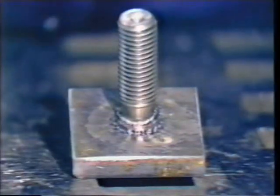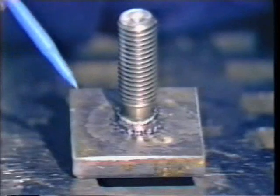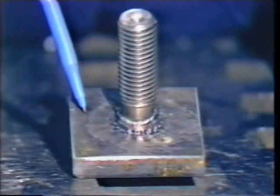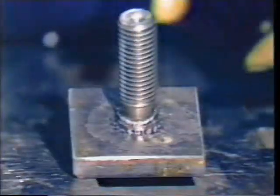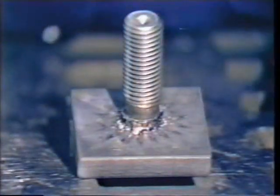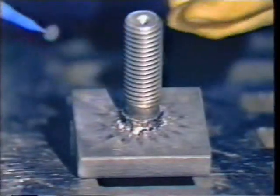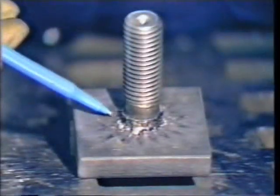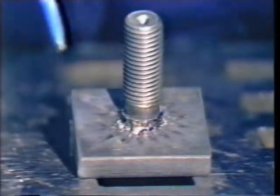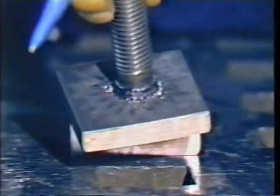If the metal is rolled under, you don't know how far under the material is rolled and where bonding begins and ends. The same weld setup onto material that hasn't had the mill scale removed is going to have more slag coming from the vents of the ferrule. This slag material is a product of the mill scale. It had the same burn-off, the same wetting and bonding, but the mill scale acts somewhat as an insulator that keeps the fillet from giving you the bright radius of blend into the base material and adds to the amount of slag coming out the vents of the ferrule. It also traps pieces of the ferrule in the material between the vents.